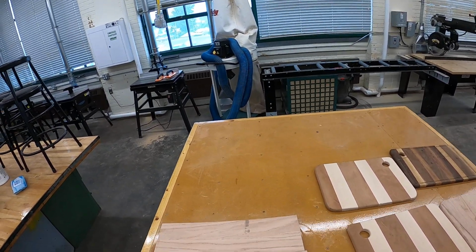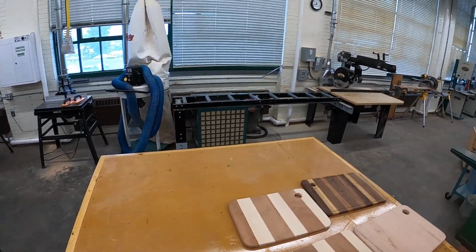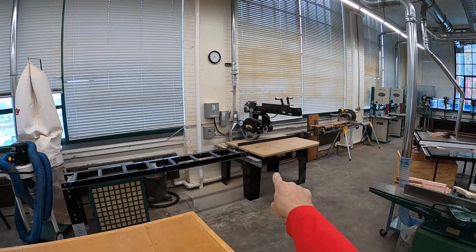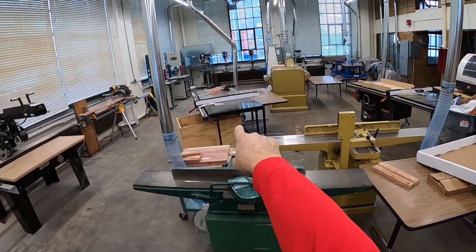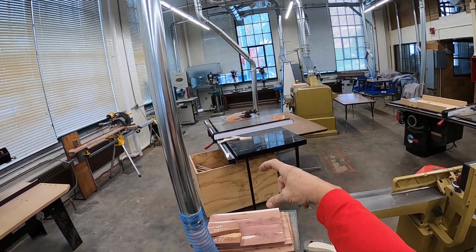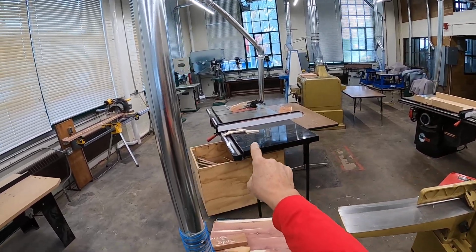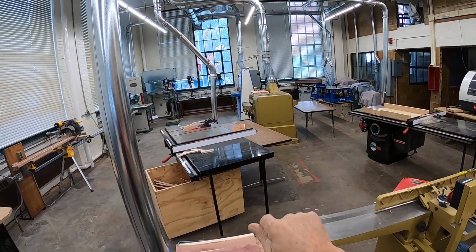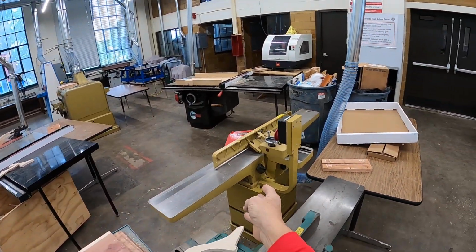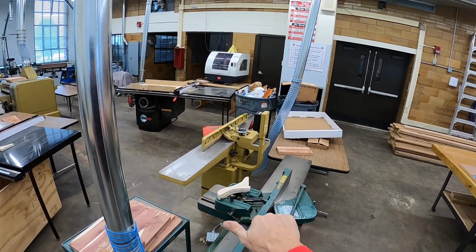Do you remember we got our long board? We had to calculate the board feet. We had to mark the long board, cut it on either the miter saw or the radial arm saw to rough length. Then we took it over to the table saw. We would cut it to somewhere around 4 inches width, not much bigger than that because of the growth rings and the warping. Once we did the table saw, we would flip every other one in grain, mark it IO, join it, right? Remember that? Join it, IO, I is in, O is out on the joiner.